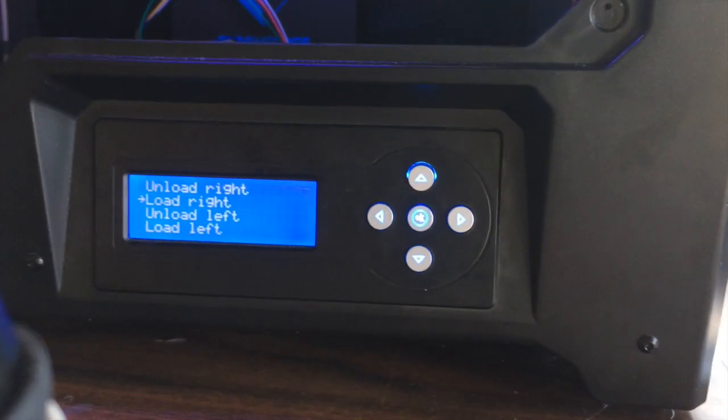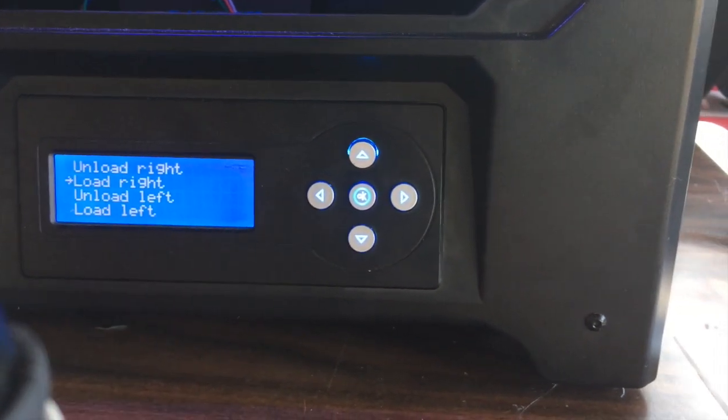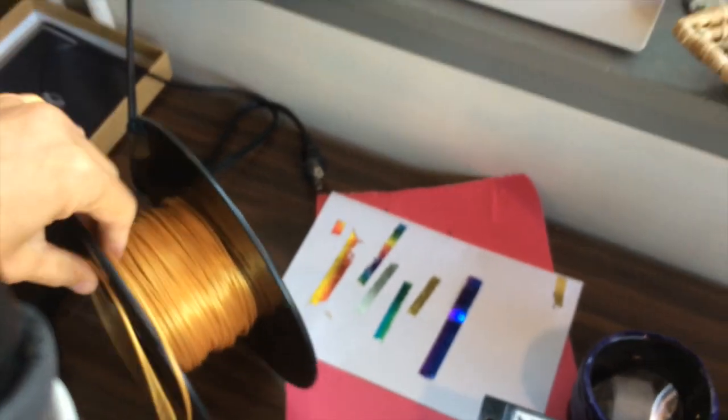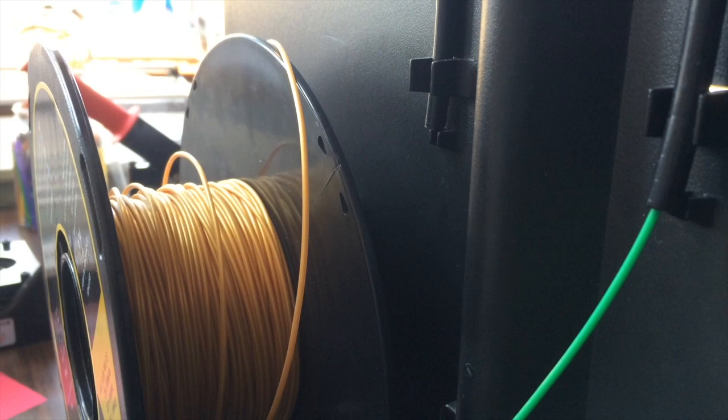Great, so now we've removed our blue PLA filament from our Flashforge Creator Pro, and we're going to install our gold filament in the machine. Follow me. Okay, to load the filament, before we do anything by giving direction to the machine, we're going to first have all our equipment ready. So, I will grab my gold filament and place the spool on the spool holder right here, making sure it comes from under and towards the middle.